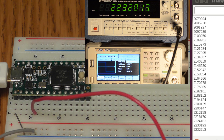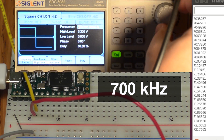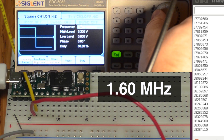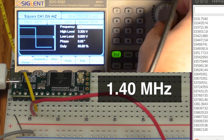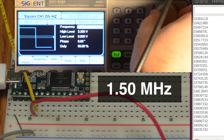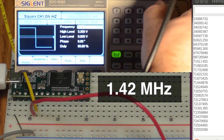Now, as a consequence of this, if we want to figure out how fast we can go, I'll connect the signal again and start counting. If I come over here and increase the frequency, as I turn this number up, when I get to a frequency that is too fast, we'll see the numbers in the serial monitor stop. At 1.4 MHz they're still going, but at 1.5 MHz the processor is just not fast enough to execute 1.5 million interrupts per second. Because it's the highest priority, nothing else gets to run — no communication happens.